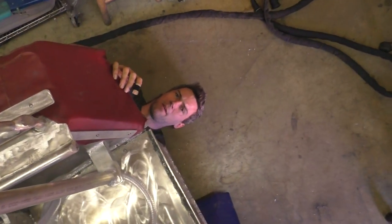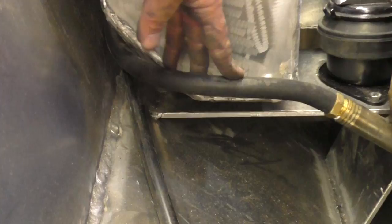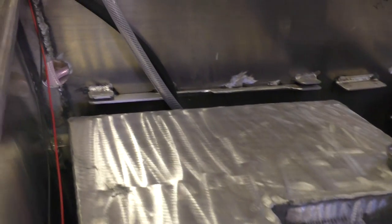We'll see if the fuel tank fits in here all right — we know it fits over the steering cable, but I also want to run the water hose down to it. The water comes off the jet pump, we're going to run it through an anti-siphon valve, up through this line, and then back down through the one that can take some heat, and it goes into our hose barb that we tapped into the end of the stainless pipe on the exhaust. Rich is done with our tripod back here and he's reassembling the boat. There is room for this water hose that feeds raw water to the exhaust to come around that tank — five feet of hose does it.